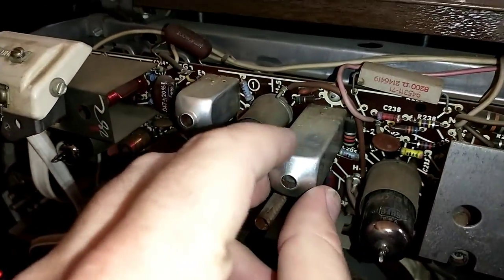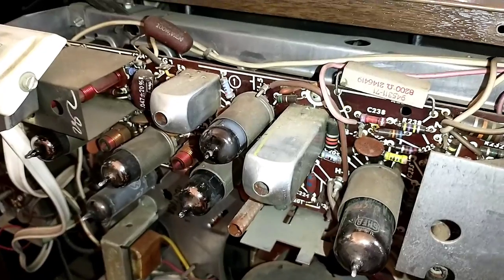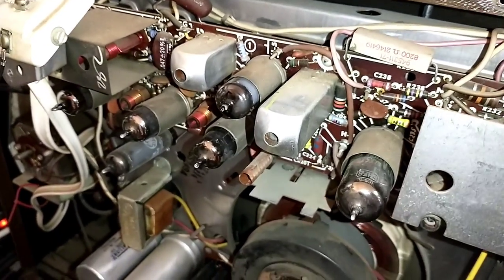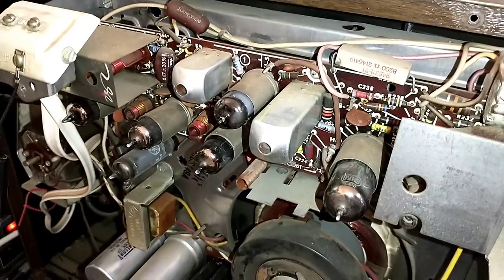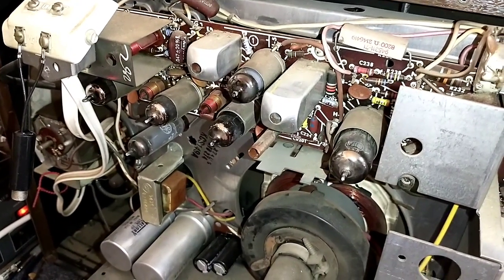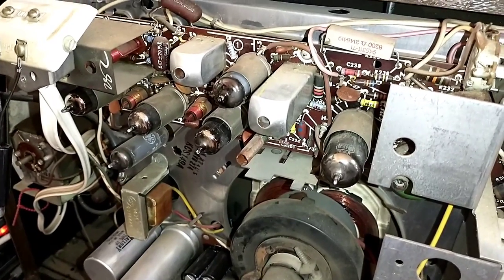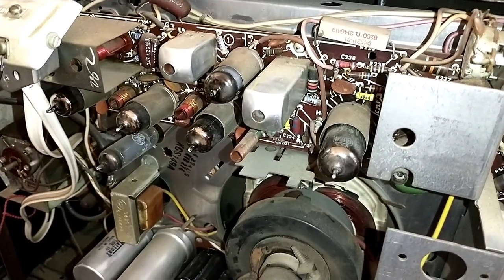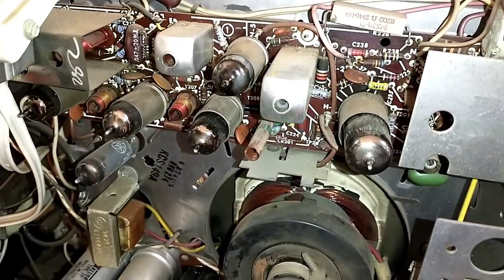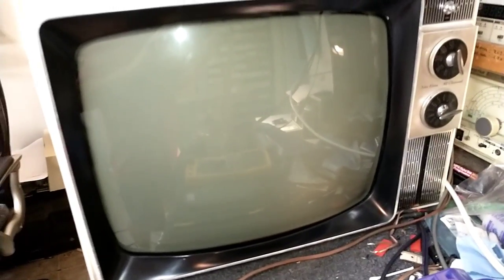Then I noticed that this detector can was very vibration-sensitive — if I moved it any which way it was cutting out. So I went on the backside and resoldered everything, then did the sound alignment, and that actually made it work. So hours and hours of chasing this problem, when I just slowed down a little bit, looked at it logically, and found the issues.